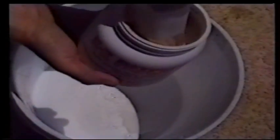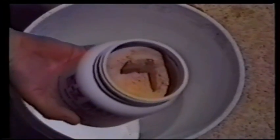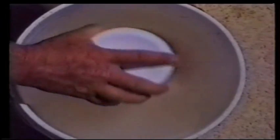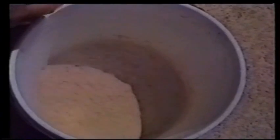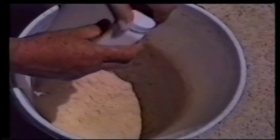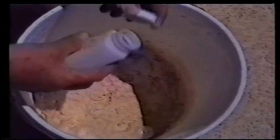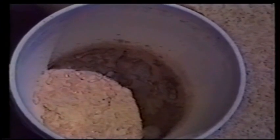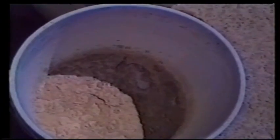It is the same color as Stegmeier sand buff that we found predominantly throughout the United States as the leading color on Kool Decking. Add 2 ounces of liquid cement bonder per 1.5 pounds of Easy Patch number 2 dry cement mix. Add water and mix until you get the consistency of mashed potatoes.